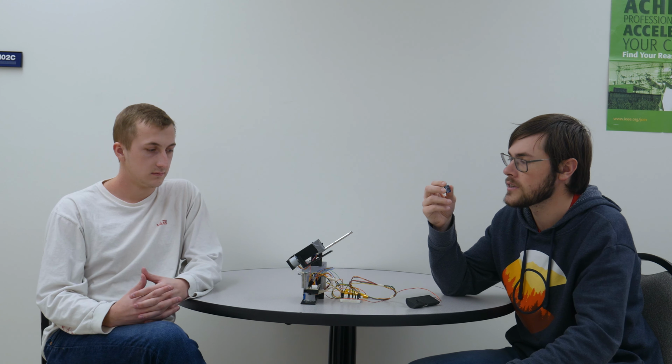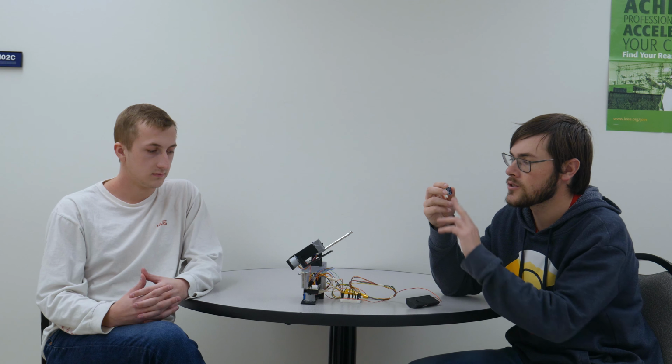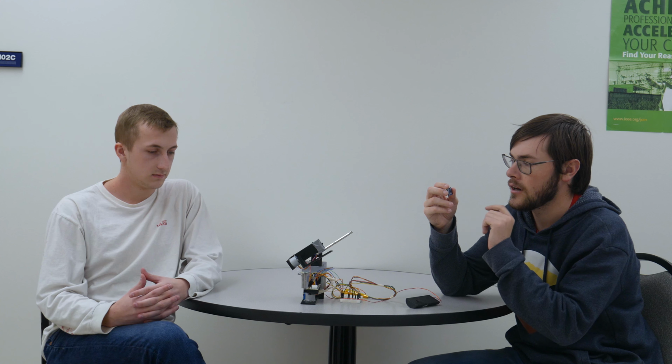The 4 other pins, which we didn't use, are 2 other SDA and SCL pins, which you can use to communicate with other devices, an AD0 pin, which is used to communicate using multiple gyroscopes, which we also didn't end up using, and an interrupt pin.